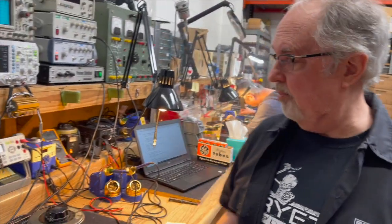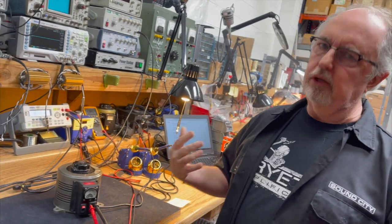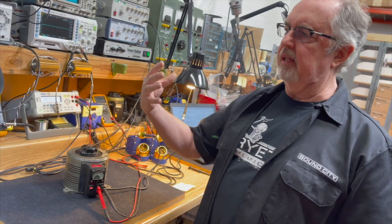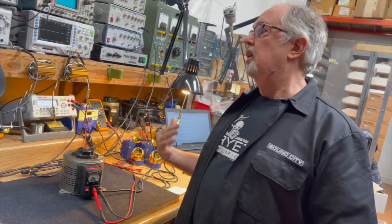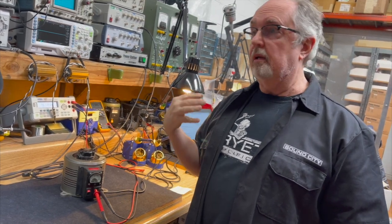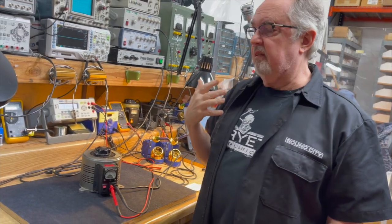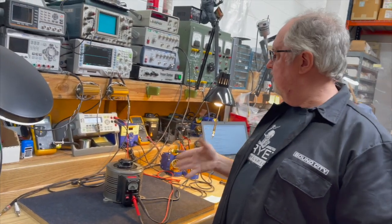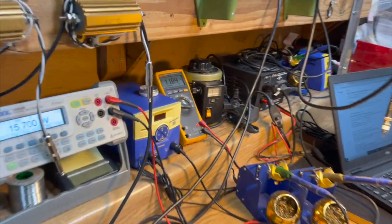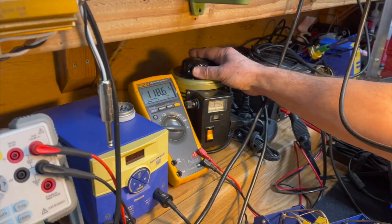Are those other variacs up there? We use variacs all over the place. Regulators are really expensive. They're huge, and we could use them to regulate the test voltage here, but it's kind of overkill, and sometimes we want to vary the voltage. We basically test things at a voltage, and we monitor the line voltage coming into the work area. And then we compensate accordingly over here.